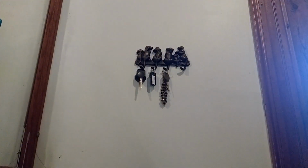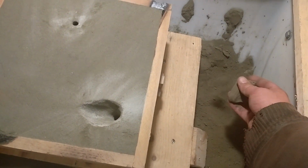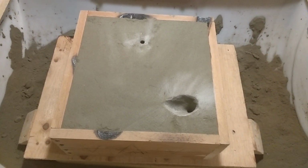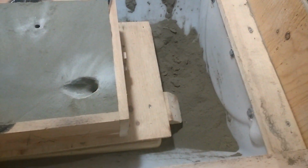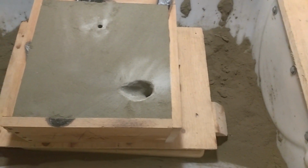Anyhow, that's another story. Today we make the skull-shaped ashtray. It was technically a little below freezing out when I made this mold, so it was interesting working with my sand in those conditions. It wasn't quite frozen enough to make it completely lose its stickiness, but I did have to do a little extra ramming. But like I said, it was just barely below freezing yesterday. I found it unusual my sand had stayed fresh in my bench basically since just before Hallowe'en, when I got it ready to make this mold last time. And before it froze a couple days ago, the sand still felt just as good.